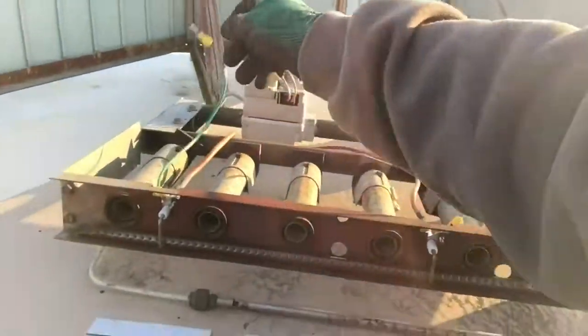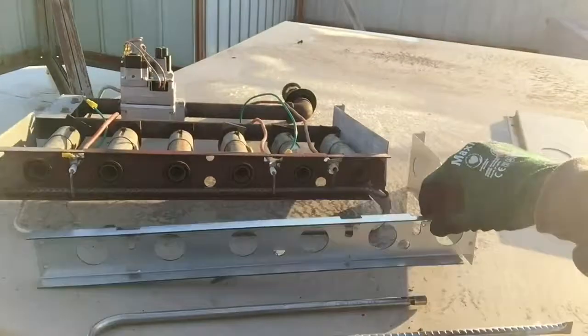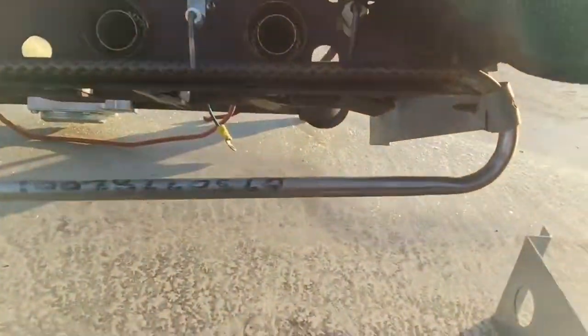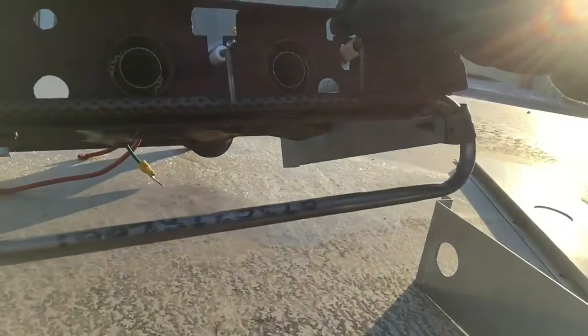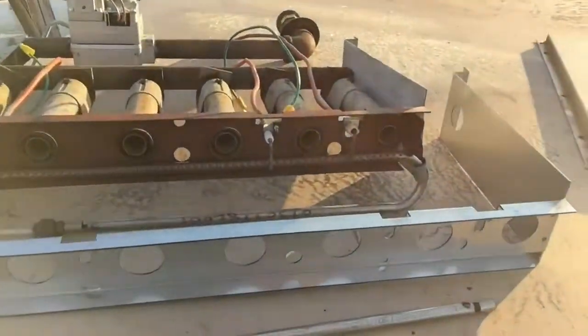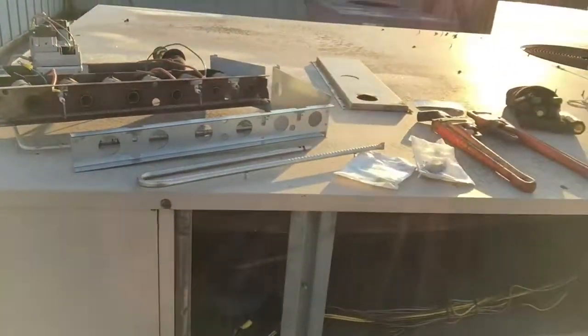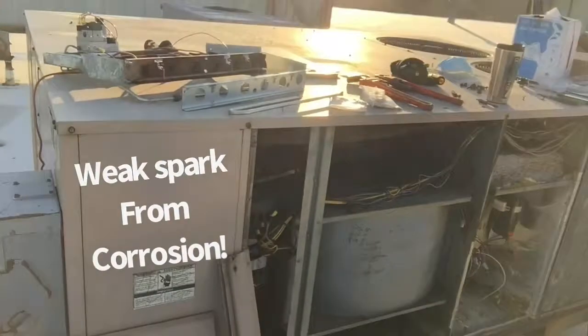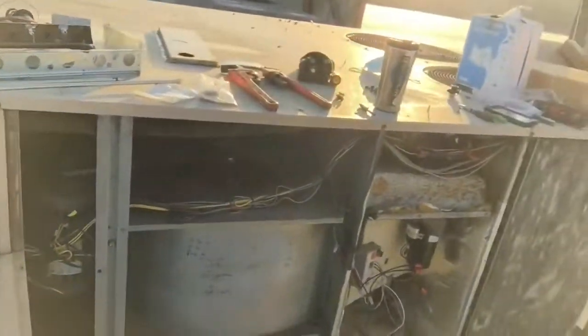I tried re-grounding it just to buy myself time, give the customer some heat until my parts arrived. The burner plate — the brackets are rotting out. It has to sense ground in order to work properly. Ground can make a big difference. I've had ground issues in the past on random equipment, and it causes nuisance problems like this.